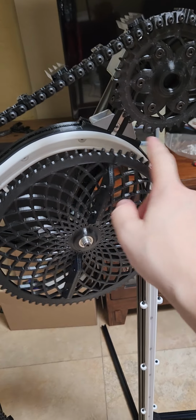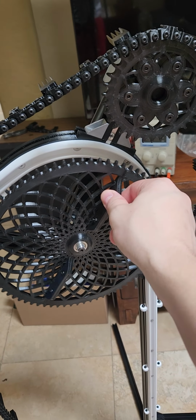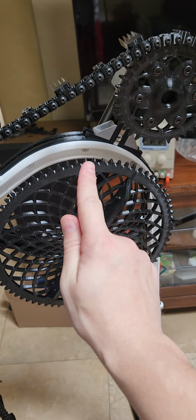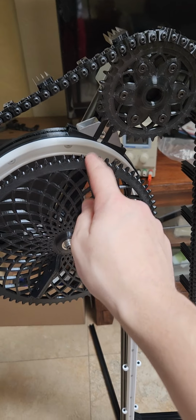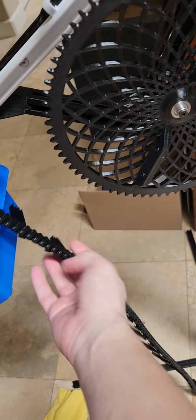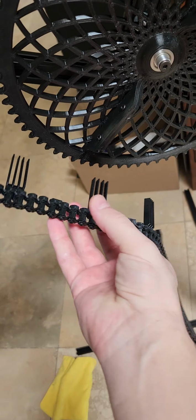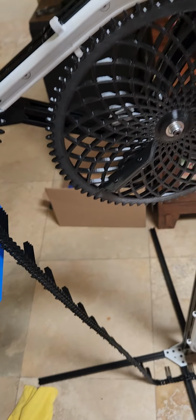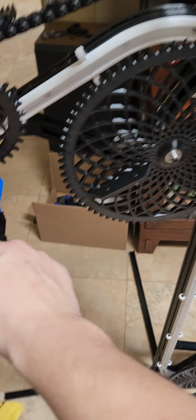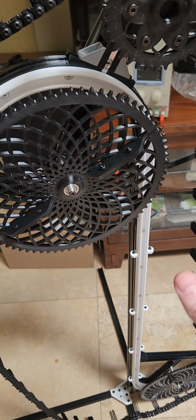All right, what's happening there is the sprocket teeth for this exact sprocket design are slightly too far apart. And by slightly, I mean 0.03 millimeters too far apart for the chain. So when the chain stretches, it needs to have a sprocket that is perfectly aligned with the stretched length. The first sprocket I did was the exact amount. This one I overcorrected a little bit. I took a measurement, turns out slightly too high.